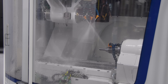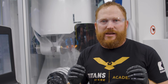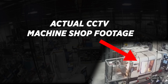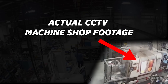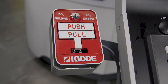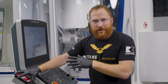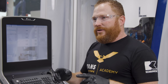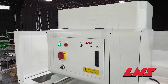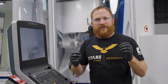Grinding oil is flammable, so we have to make sure our fire suppression system is ready to go — we got that all hooked up. If you didn't see the video with our Studer S41, we have CCTV footage of a machine lighting up and the fire suppression system kicking in and completely knocking it out. This machine is equipped with a thermal sensor and a pull station so in the event of a fire we can put it out without damaging the machine. Along with that, we have an LNS Fox HE-1000 mist extractor to pull all those particles out of the machine so you're not breathing any of it and you're not going to start a fire.